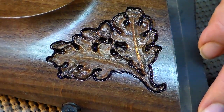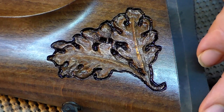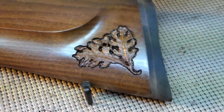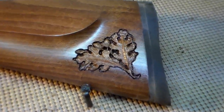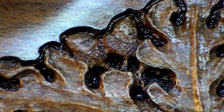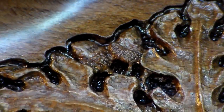What I have now is I've coated it with, after it dried, a mixture of mineral spirits and a true oil finish from Birchwood Casey. As you can see here, it is all set, all ready to go, just drying right now. One thing I want you to notice — if you can get close enough into those acorns — you can see the texture that's there. It also held a little bit more of the actual stain, so it got slightly darker, but it does show.